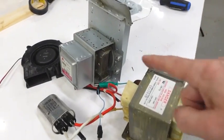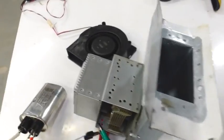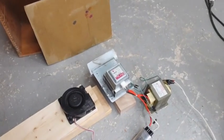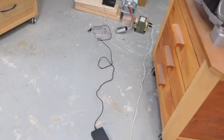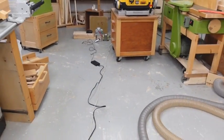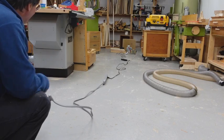I've got this wired up now with the magnetron bolted to the waveguide, and I bent it a little bit to maybe direct the microwaves, plus I added a blower to help keep the magnetron cool. I want to see where my liberated microwaves go, so I'm aiming at this wetted cardboard. I've got a fan here and a long cord for plugging in, because I'd rather not be too close while this activates. I'll just let that run for a few seconds and then measure it.